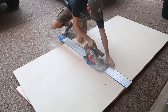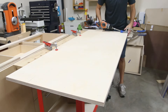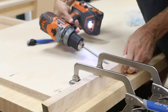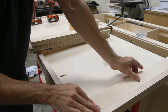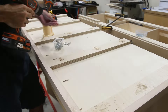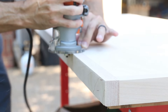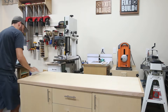The final piece of the cabinet is the top. I made everything to this point out of just two sheets of plywood, and I used a portion of a third sheet for the top — though you could make a solid wood one or use an off-the-shelf countertop. To give the top a beefier feel, I trimmed it with an inch-and-a-half thick piece of maple hardwood, using glue and pocket screws on the underside to attach the trim to the front. I mounted spacer strips on the underside to raise it off the base and give a spot to attach screws from underneath. I flipped the top over and cut the front trim flush with the sides using my flush cut saw, then rounded over the edges with my router and sanded everything to 180 grit. I applied two coats of water-based poly to the cabinet and three coats to the top.